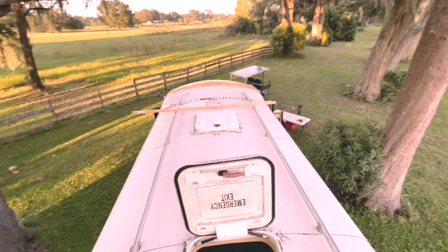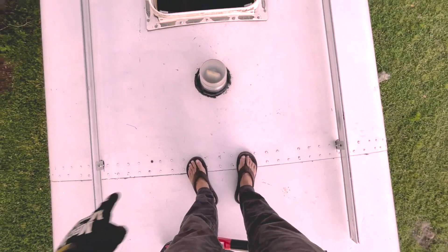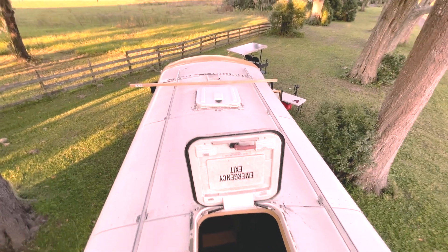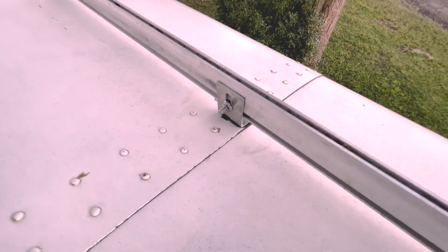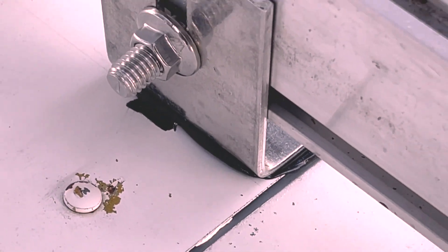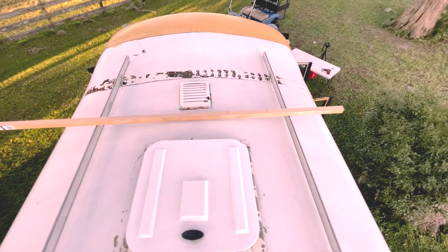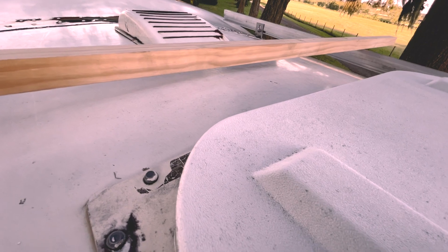Both rails are now on. I've got about a half-inch difference — I'm at 53 and a half from outside to outside on one side and 54 on the other. That's so inconsequential no one will notice. A couple of notes: don't try to dress up the adhesive caulking — you'll just make a mess. Put it on there, let it squeeze out, let it go. The solar panels are going to have plenty of breathing room, and I like to have it as low profile as possible — half inch to one inch off the roof is just fine.